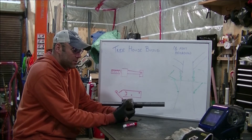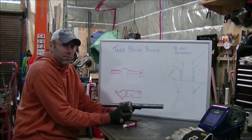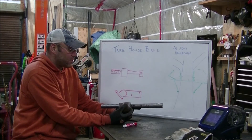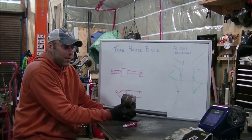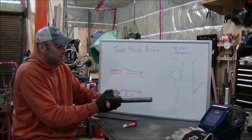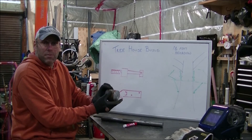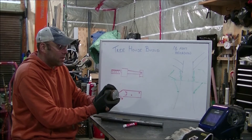This is going to be the boss that goes on there. We have to open it up, press it on, and possibly give it a little weld to make sure it doesn't go anywhere. What this does is rest against the tree, giving it stability so this doesn't bend, and then the tree will eventually possibly grow over this, giving it added strength.